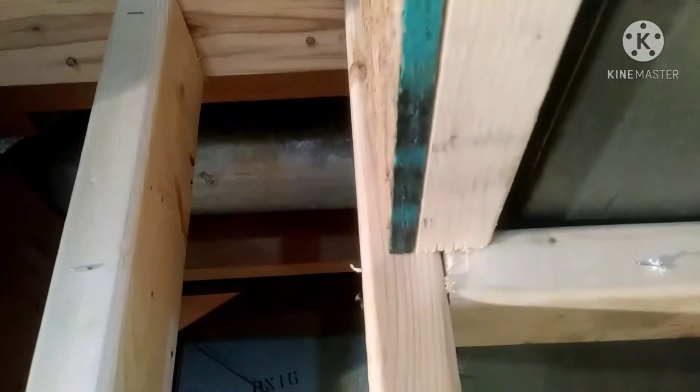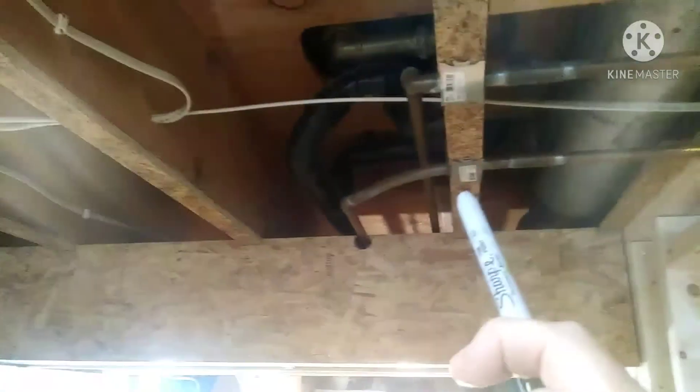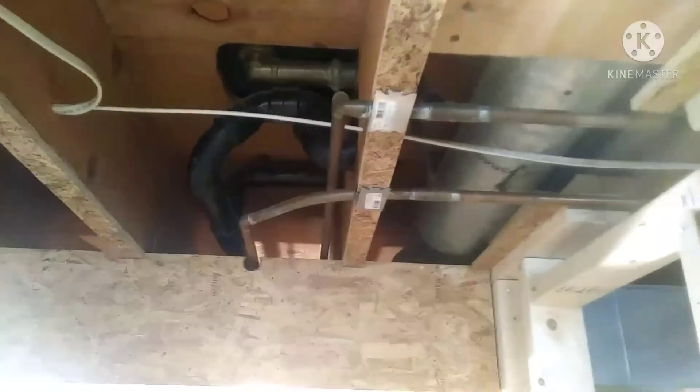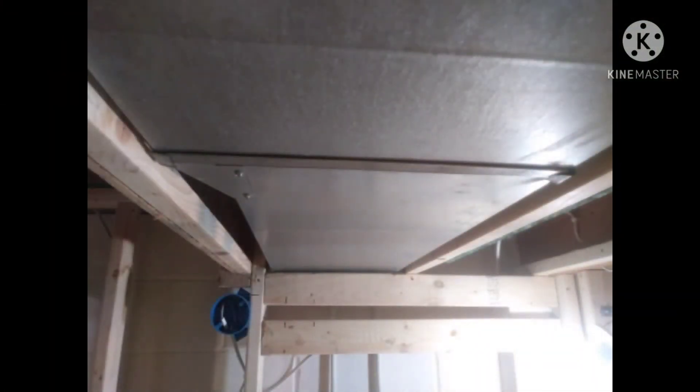On this side, that 2x4 is close enough, but you just square up these panels straight up and down and get a nail or a screw in there to hold it where it needs to be. After I got my nailers in and the floor joists furred down for my drywall, if you're doing anything like this, make sure you get nail plates around anything — water lines or wires or anything like that. And that's about it. If you need low clearance drops, I hope that helps.